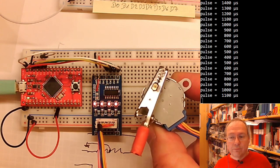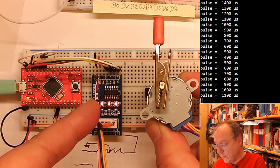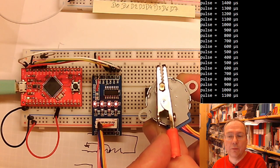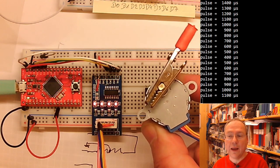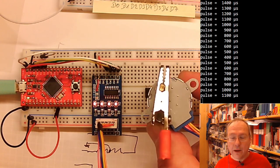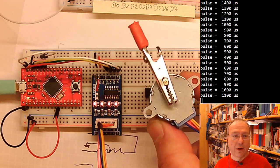And the positive thing with these motors is that you can very accurately position them. But it's an open loop system. There's no feedback, unlike the servo motor, so you don't get any signal back from the motor about where it currently is. And if you stop it like this now, it will still go through the sequence. The microcontroller doesn't know that it was stopped, and then you lose control of the position. In a 3D printer, you have endpoint switches, which tell the microcontroller controlling the 3D printer when the motor reaches the end position, in order to recalibrate the position where it is.